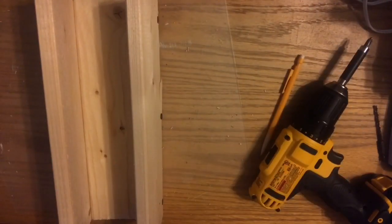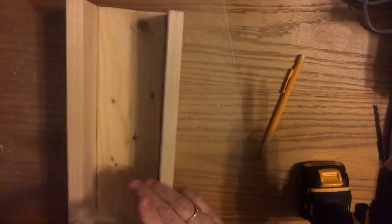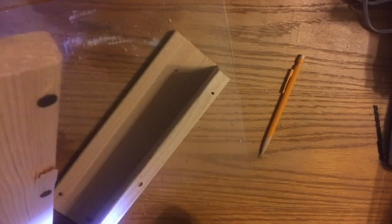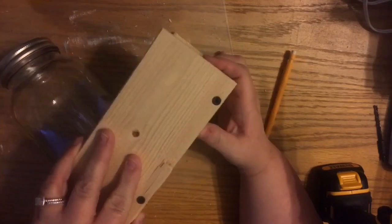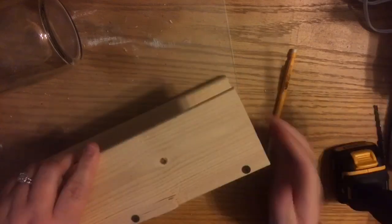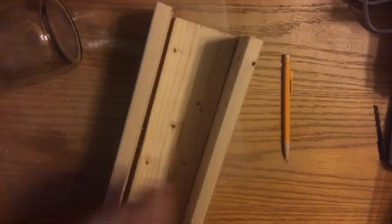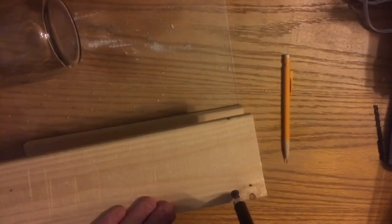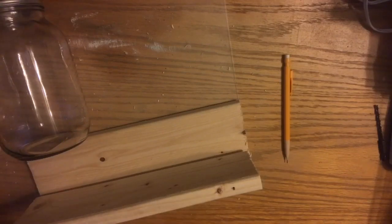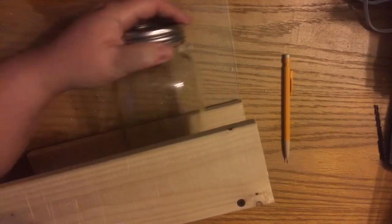It's funny because I actually pre-measured — I put the jar in to see if the space was wide enough and it was, but not until I put the sides on. Sometimes your wood can bow and I think that was part of the problem here. So I'm loosening it up a bit because the jar didn't fit. The jar fit on one side and when I slid it across to the other side it got tighter. So I'm using the jar as a spacer, but be careful — you don't want to accidentally screw into the jar. It did take some adjusting, and I left it on there to show you guys that sometimes you have to figure it out on the fly.